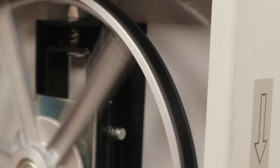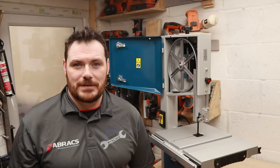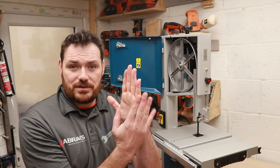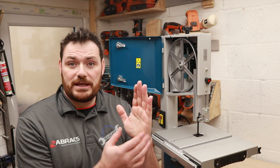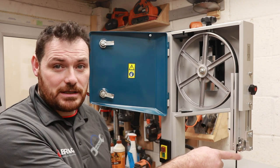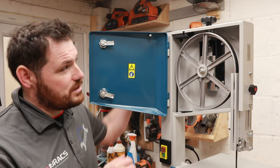Now if you watch the blade you'll see it start to track towards the front of the top wheel, and that's because I put the tension into it so it's pulling it forward. So we need to adjust the tracking. If I adjust the tracking in the back here it tilts this wheel, so I'm trying to tilt it upwards slightly and you should see the blade moving back. I want the blade so that the gullet of the blade is in the center of the wheel - a bite like that is looking right for me on this particular bandsaw. The reason why you want the deepest part of the gullet in the middle of the wheel is so that all the tension is on your teeth. When you come to set your blade up all the tension is in the teeth, and whatever you cut is going to make a straight cut. Then all you need to do is control the back of the blade with the blade guides. You check the tension of the blade as it comes onto the wheel, not as it comes off - where it does the cutting - and you want the deflection there about six mil. Mine's a little over six mil so I'll just adjust the tension.